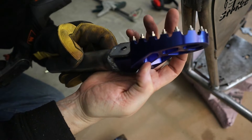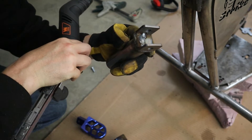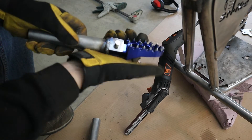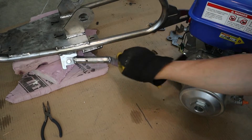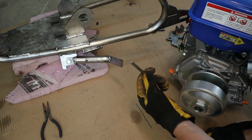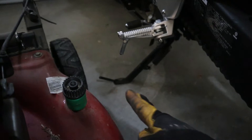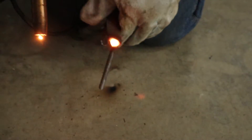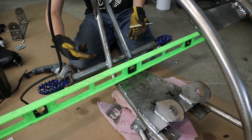I welded a seam line on the inside for the foot peg so that when everything bends up into place it hits a stopping point and remains straight. I need to measure with the foot peg in there, slowly shave it down, and test until I get a good straight fit. Now you can see the welding line — everything on the foot peg is nice and secure. Don't forget to weld the foot onto the leg of the kickstand, then you can put this on your frame. There's one problem: I need a nubbins because the torque converter on the engine sticks out pretty far and I need to get my leg around it when I flip the kickstand down.